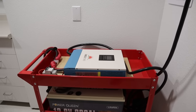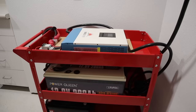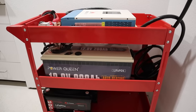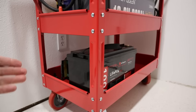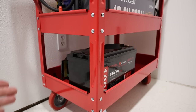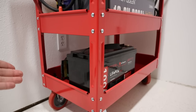The total cost of your main components is going to be right around $1,800. By the time you factor in the cost of this cart, cabling, circuit breakers, and fuses, you're going to be closer to $2,100 — which is only 41 cents per watt hour. On the cart I have a second shelf on the bottom, and for reference I've put one of my 100 amp hour lithium iron phosphate batteries there — you can fit four batteries on each shelf. So if you wanted to upgrade capacity down the road, you could purchase an additional four 100 amp hour batteries for a total of 10,000 watt hours.